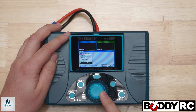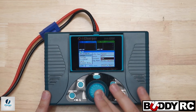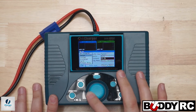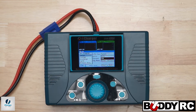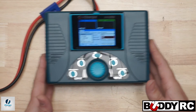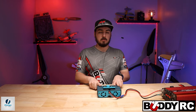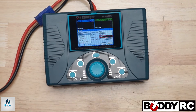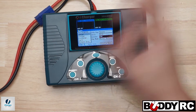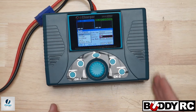Go ahead and select it, then tab over and scroll down — you'll see it now goes to 50 amps. Before, one channel would only go to 30 amps; now you can go all the way to 50. The way you hook this up is positive to positive and negative to negative, combining two outputs into a single connector plugged into one battery. The cool part is you only need to plug into the left balance board, and you'll see the output from both sides displayed on the left side of the charger.